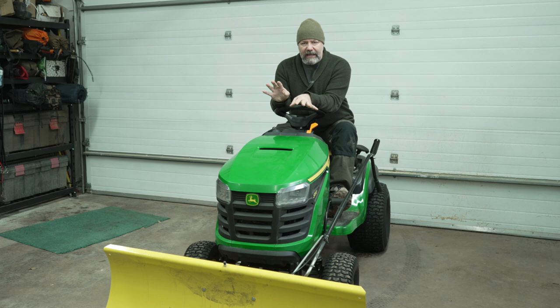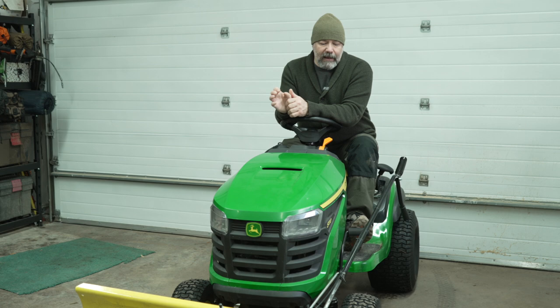And I gotta be honest, I did tweak the blade once. I thought it straightened it out, but even so, it should ride on those pads and level up. One pad's still intact, but the other one, the bottom is obviously gone. So in the little project today, we're gonna take off the existing one that's intact, and we're gonna strengthen that one, and we're gonna take off the broken one and rebuild that one.